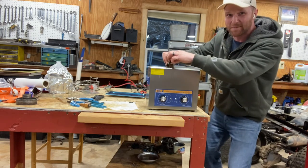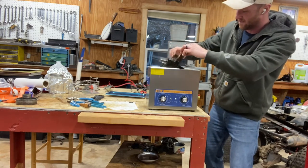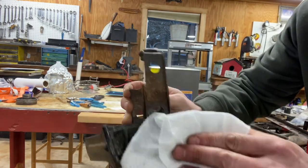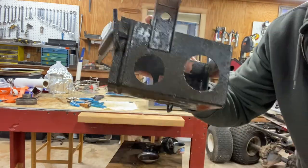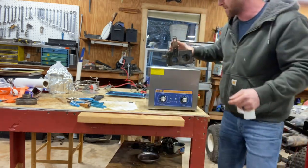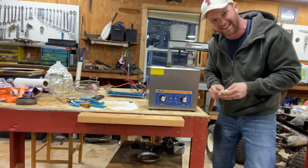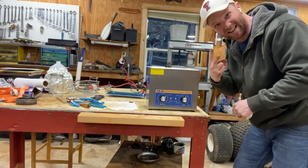We've got 30 minutes at 175 degrees full of Evapo-Rust with the rustiest part at Mower Mike's garage. Let's see what she came out with. I will note there are some funny fumes coming out of here — things are getting weird. Oh buddy — it's looking pretty gnarly. Boy, look at that — that actually came out better than I expected. As you can see it's a little hot, but it did take off most of that rust. I mean it didn't take it all off, but I think if you left it overnight it would clean this whole thing off totally. I'm a fan of Evapo-Rust — if you need a quick hit, Evapo-Rust works great with the ultrasonic cleaner, gives a little extra boost to clean off the rust. So with that, I'm out.